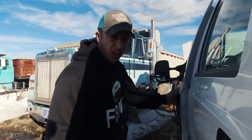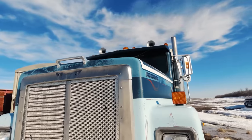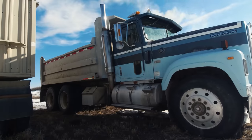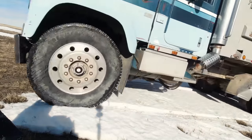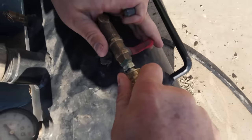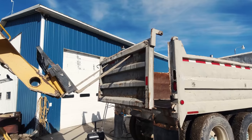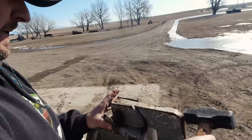That's what I like to see - not that that's okay, but one little jump, I like that. I stopped in and they filled me up, so I'm gonna go dump this behind the building. We've got a spot we like to dump the gravel. This stuff isn't quite the type of top gravel I'd want to put down for the final surface, so we'll just use this as a base. It'll work great but it'll pack real hard - a lot of sand, a lot of gravel. Not terribly expensive either.